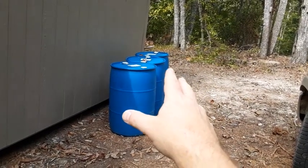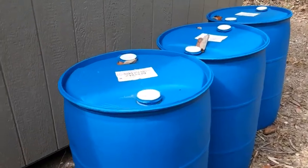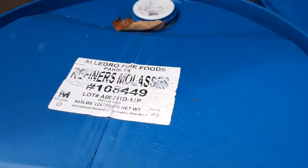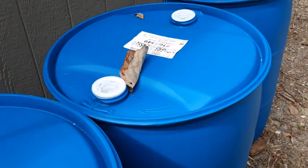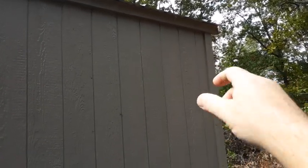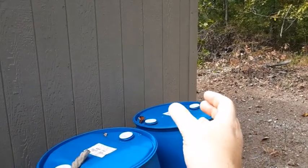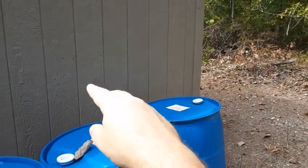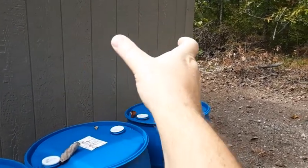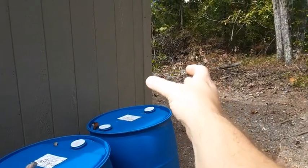Our off-grid water solution will include many of these 55-gallon poly drums. Most times they got vinegar or some kind of food in them, some shampoo, who knows. These here had molasses. So we'll be using these and we'll get them all strung together, and then along the gutters we'll build a rainwater collection system with a first flush and a leaf dumper to get rid of the leaves, and then we'll put a filtration system in there to get all the bulk of the material away, and that gets filtered. And then inside the house, once it's plumbed in, anything that we use for drinking water in the future will have a 2 or 3 filter system consisting of a paper cartridge, a carbon cartridge, and maybe possibly a ceramic cartridge.